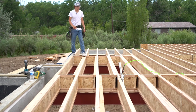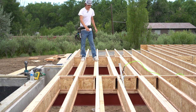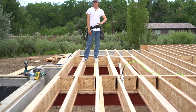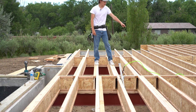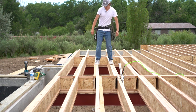We just finished up our joist floor system here, and this is a little detail we had to add for a kitchen island. There's stone going on top of it, so for some more rigidity we need to double up all of these joists. Here you can see we have single joists, and then right where the kitchen island is going, we doubled up.